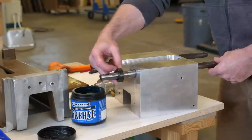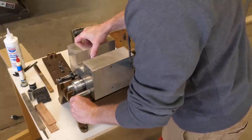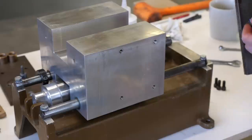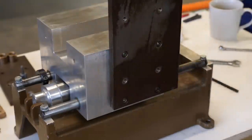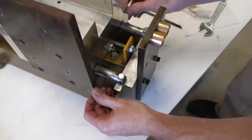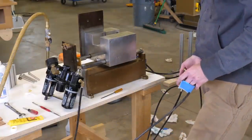I don't know what this thing is called, but it is a single block of aluminum that slides up and down on two steel rods and is propelled by an air ram. Once this assembly is bolted down to the main backbone piece, it gives a good sense of how the tool works. This is the motor mounting plate. Here's the bushing mounting plate — I leave this loose because it needs to be aligned with the drill head. This is the forward stop, which sets how far the drill plunges. At this point I hooked up the pneumatics and went for a test drive — I was pretty proud of my work, so I did this for way longer than I needed.